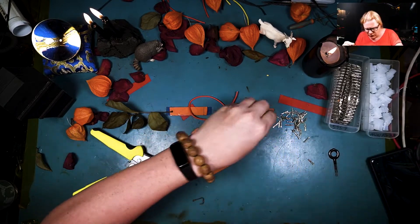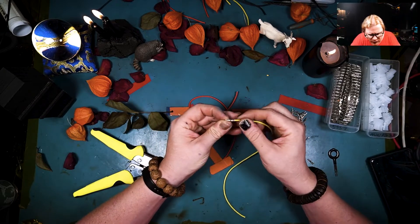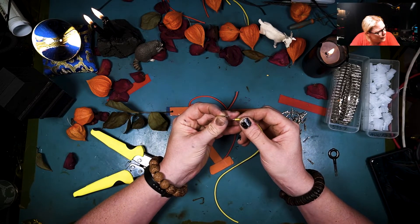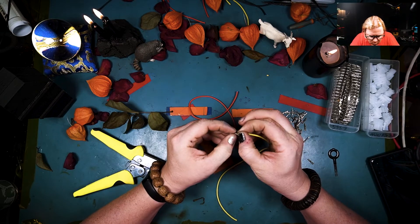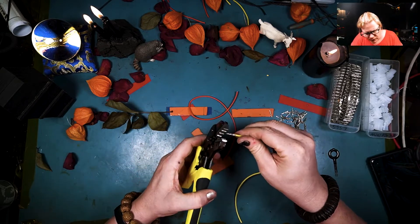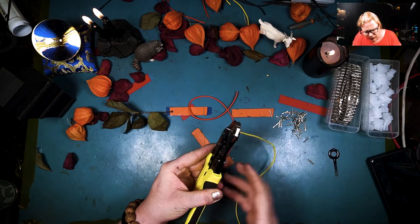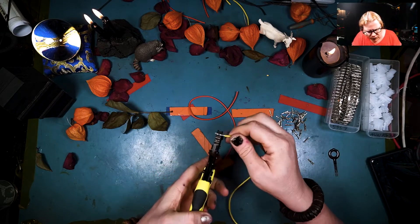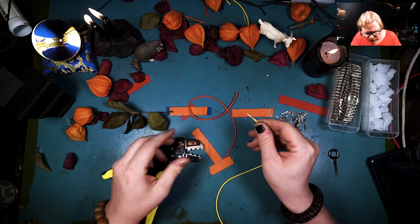Sometimes less is more. If you want to know you're making it the right length, you lay it in here. The larger wings are specifically for holding the cable, and the smaller ones are for holding the wire. I'm just gonna put that in there like so and see if I can do this again without looking like an idiot. Spin this around, place it in there so the saddle's in the right spot, crimp, move it up one, make sure it's pressed in properly — there we go. We've got two connectors, simple enough.